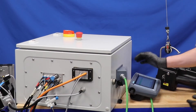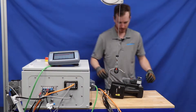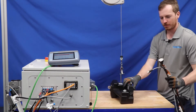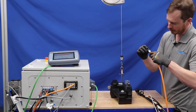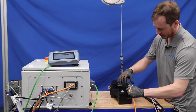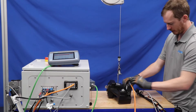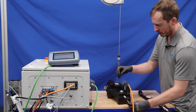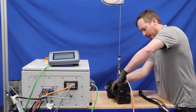For further information refer to the electronics and HMI video linked in the description. To connect the tool to the controller there are three main connectors. You have the motor cable which has two arrows that help align the cable — push it all the way in and then rotate it a quarter turn and it is locked in place. There is also the data cable with an alignment notch on both sides, so just find the alignment notch and then tighten down to a snug fit.